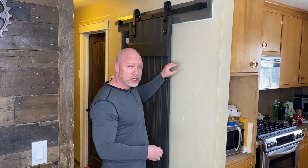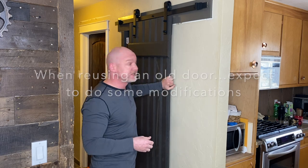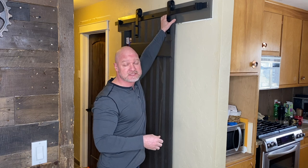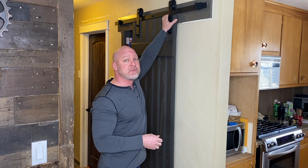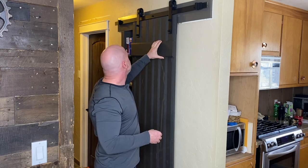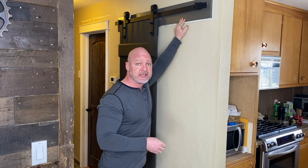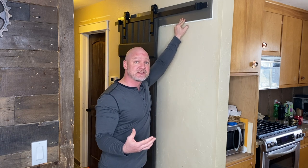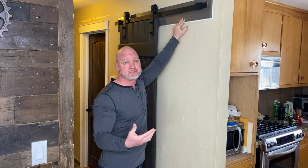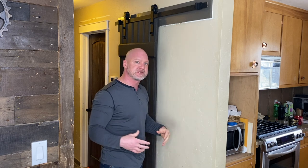This hardware requires a certain depth for the type of panel you're going to attach to it. The door was too thin, so basically on the backside where it mounts, I added a one-by-three to accommodate for that thickness. Another thing with this is you do have to have some kind of a header. Depending on the size of the door and how heavy it is will determine how much you want to beef it up, but you always want to beef it up as much as possible.